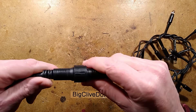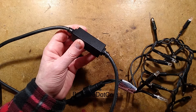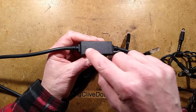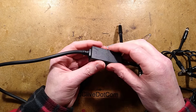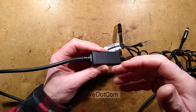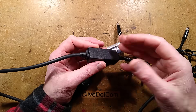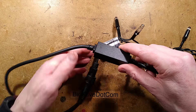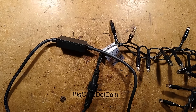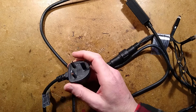At the other end of this string of lights is a connector, and then you have to buy this separately — when you buy these lights you get the mains lead with a bridge rectifier in it. Normally I'm used to the bridge rectifiers being injection molded on, but this one is a little box that looks sealed. I've had issues in the past with industrial lights where water gets into rectifier boxes and basically dissolves all the contacts away. I wonder how waterproof this one is — I may have to break it before the end of the video. Anyway, let's plug them into the analyzer.